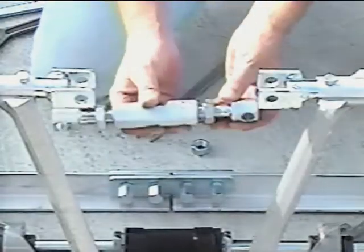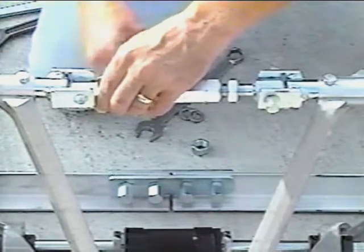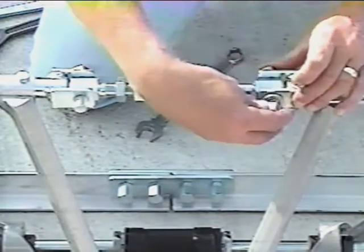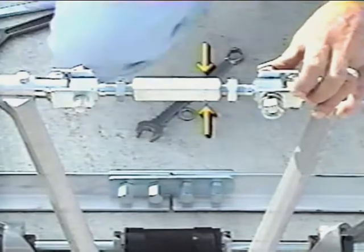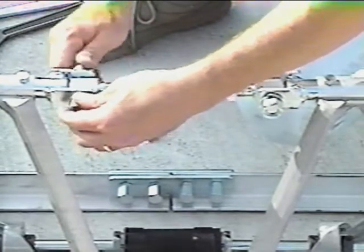Step 3. Loosely attach the turnbuckle assemblies into the yokes provided at each end of every screed section. Do not tighten any of the hardware. Keep the turnbuckle hardware loose. Note that the notches in the turnbuckles must all be positioned to the left or right. Repeat the loose assembly process from section to section throughout the screed.